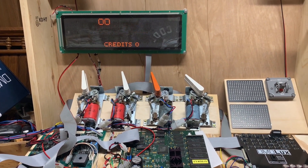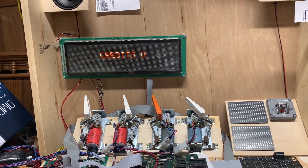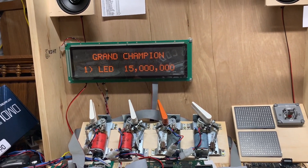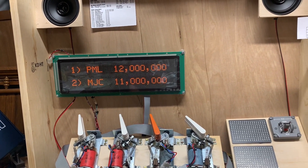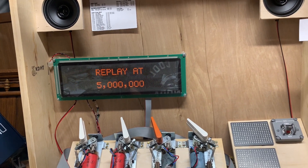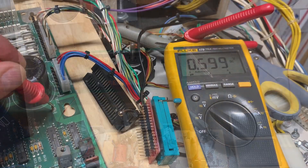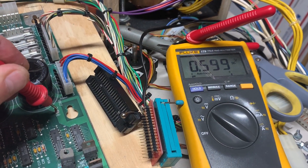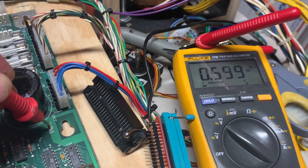The MPU booted fine, but when I try to operate any switches, no joy — which makes sense because there's no 12 volts, and the MPU needs 12 volts to do switch detection. Interesting that it isn't called out; usually you'd get a 'check F114, F115' message, but the test ROM apparently does not do that. So let me go back and fix this 12-volt circuit.